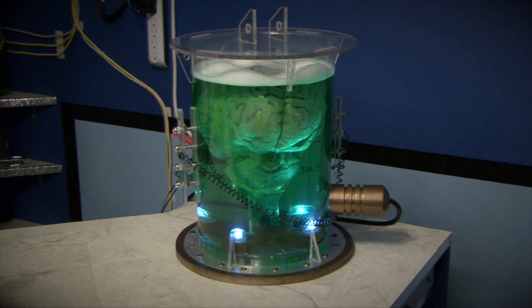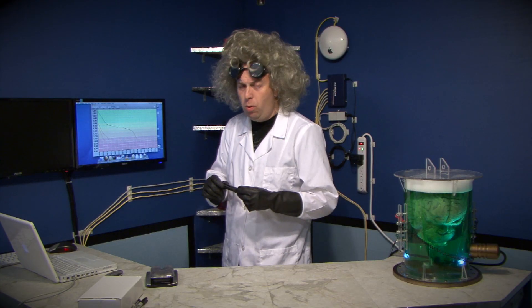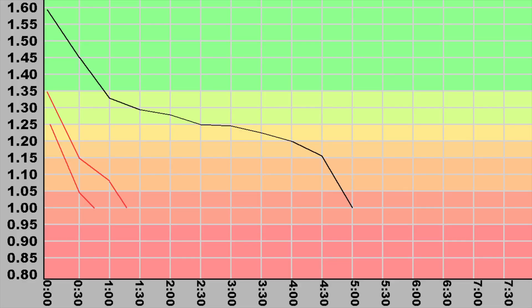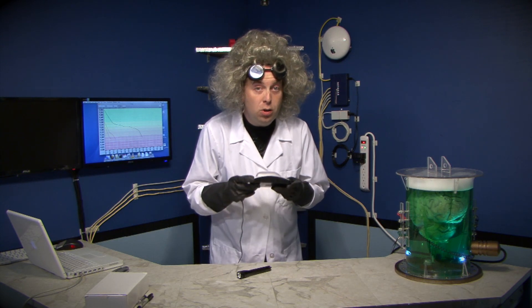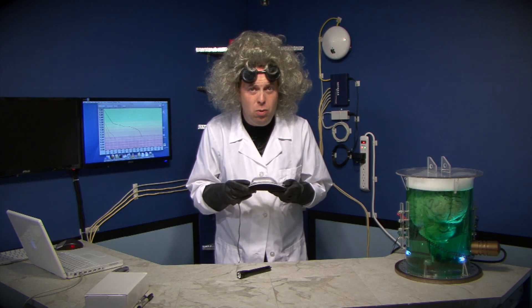Okay. And after the recharge? So, after the first recharge cycle, the flashlight operated for approximately 1.25 hours, but it only showed about 20 minutes of actual bright usable light. And after the second recharge cycle, the results were even worse. So I can only conclude that this device is junk. So it does in fact recharge batteries — however, if 20% of regained capacity is the best it can do, then it really does serve no purpose. We must destroy it.